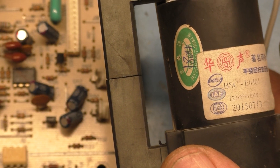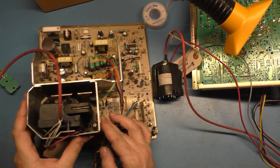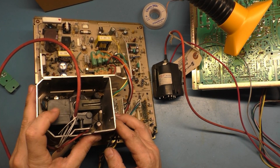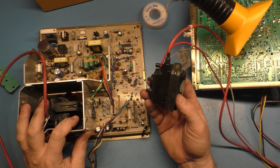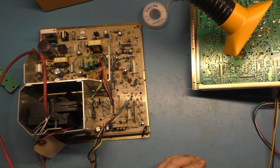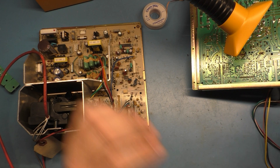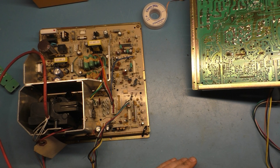We've made a discovery. If you have one of these chassis and the original bulky, gigantic flyback goes out and cracks and arcs and craps out on you, BSC E6401 is the valid replacement. Glad I figured that out. I just wanted to get this flyback out to get the correct valid part number off of it and verify that it's a valid replacement.